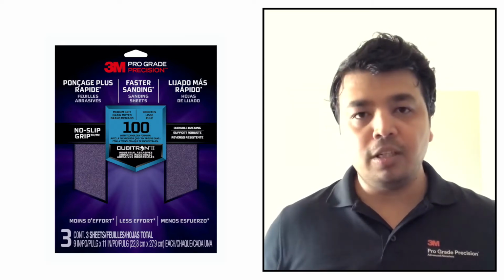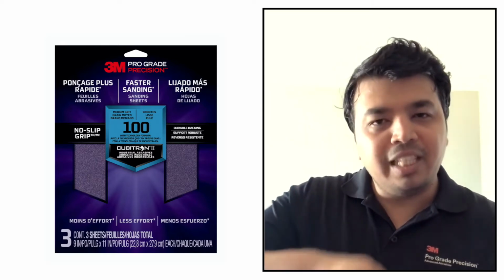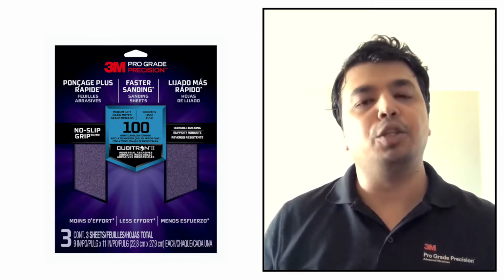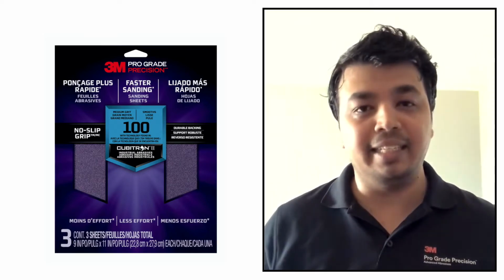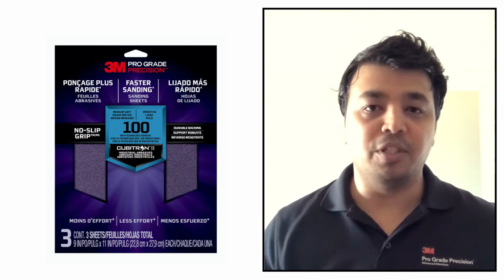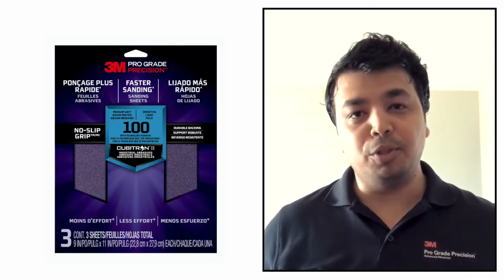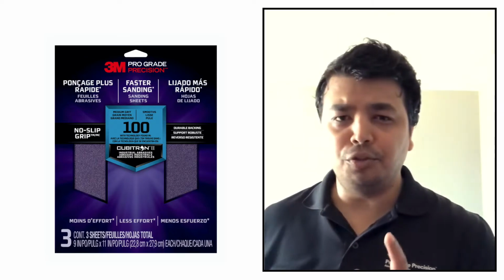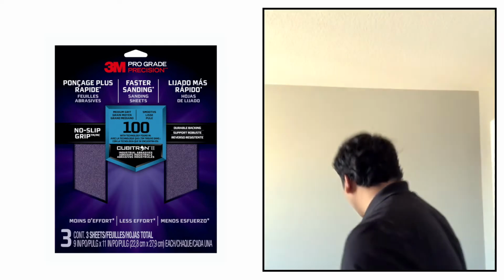Whereas the conventional abrasive does not slice, it actually grinds on the substrate, builds up heat, and then usually breaks, or the resin gets heated, and then it loses that mineral, and that's when you don't get the performance that you want. So that's the reason why this Cubitron 2 technology is amazing, it gives you great performance, and to just show that, we have a demo.